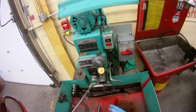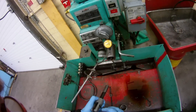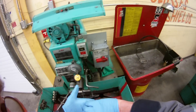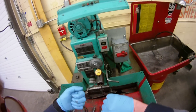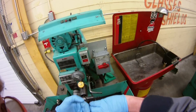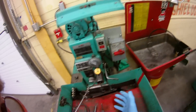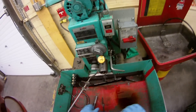So how it works is there's a little notch in the side of that, and there's also a notch in the side of this tool, and they work like this — they push and pull the honing stone back and forth. It's also possible to hook them up the other way, and it can push the stone out, but then it will jam on the part. So we have to make sure that we hook it this way so that we can release the pressure on it.